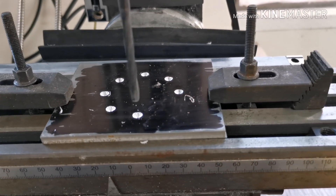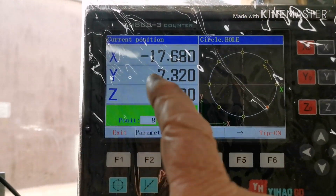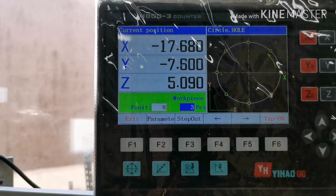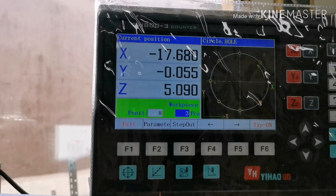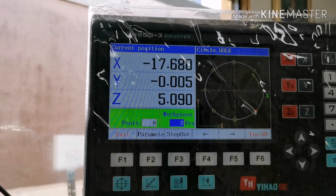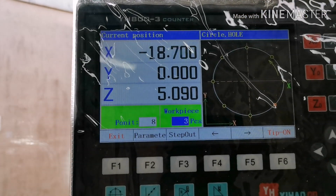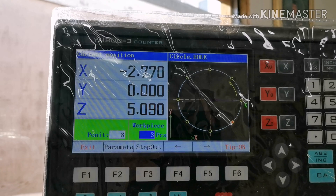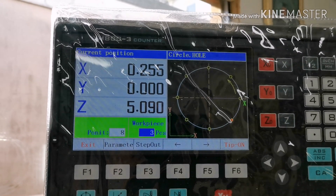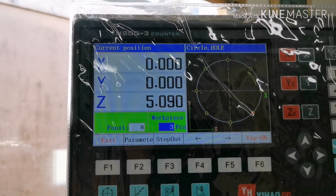As you can see, that's seven of the holes done. I'll just do the eighth one now. It goes to there — so now I've zeroed this lot. That's working to one hundredths — five hundredths of a mill. Right, so this is the last hole.